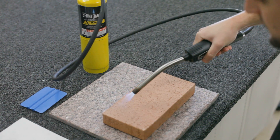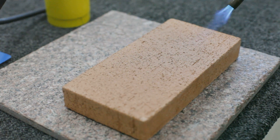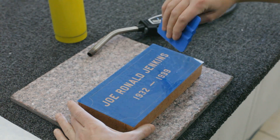In addition to that, I like to heat up my surface with a mini plumber's torch. You're just going to heat that surface up so it's hot to the touch, and then apply that mask. So now you have a great bond. That's something to keep in mind when you're blasting unpolished or porous surfaces.